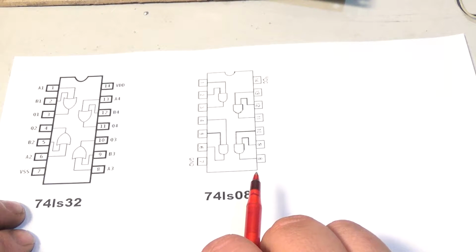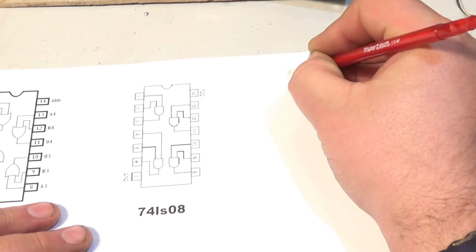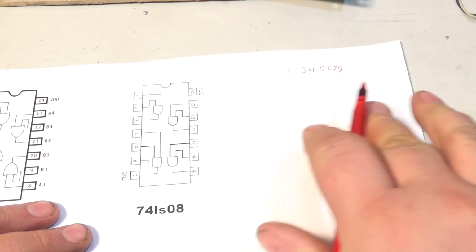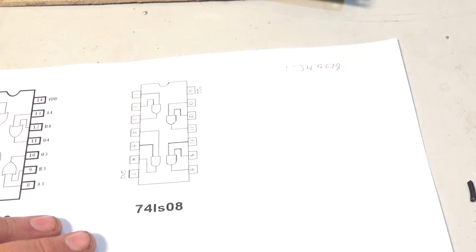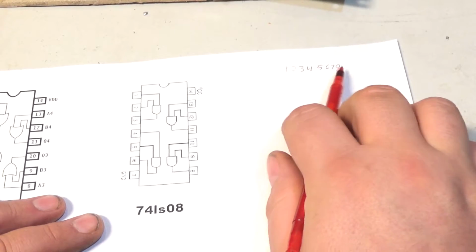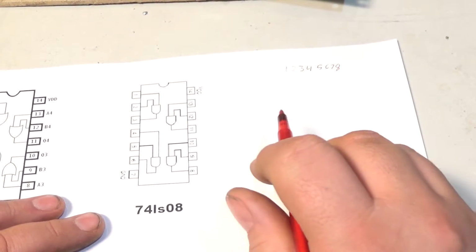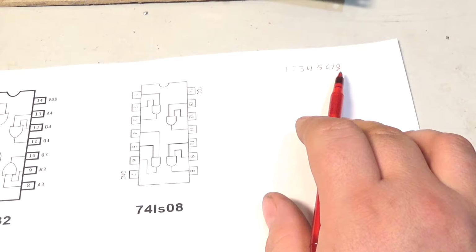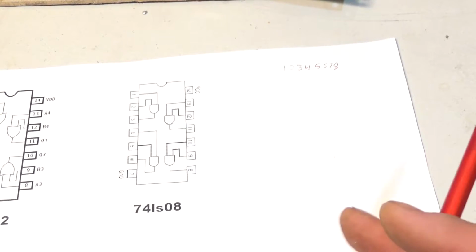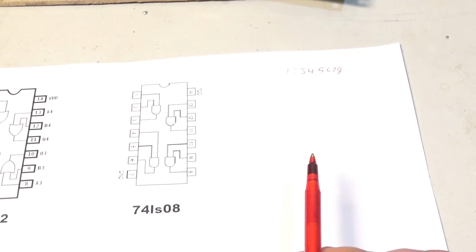This is super simple, but if you don't understand what this is, I'll explain it. Let's say you have 8 lines of data, 1 through 8. Each of these numbers stands for a wire, so you have 8 wires coming in, and each wire you can call a bit. Everyone's heard the term 8 bits of data, but do you understand that it's literally just wires? There are 8 wires that can have ones or zeros.